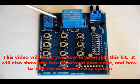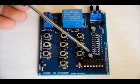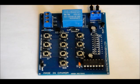How it works is you hardwire in the code on this panel on the right, and we'll talk in detail about how to hardwire that up so you can make your custom code. When you enter in the correct code, the relay turns on for a predetermined amount of time based on this electrolytic capacitor. It's probably closer to two seconds in my current configuration, using a 10 microfarad electrolytic capacitor. This video will show you how it works, how to wire it, how to put one together from scratch, and we'll also use the relay at the end of the video to power an AC lamp.